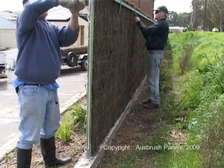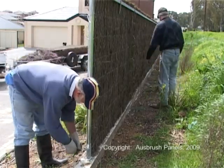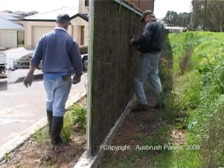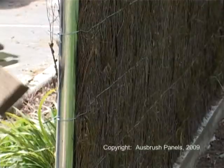If you watch very closely the point where the wires are actually twisting together, you can see the wire start to craze if it reaches a point where it's going to break. So keep a close eye on that as you twist until you get the feel for it.